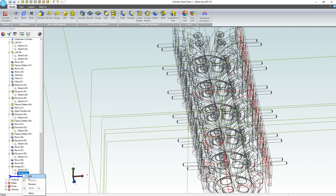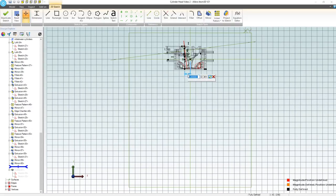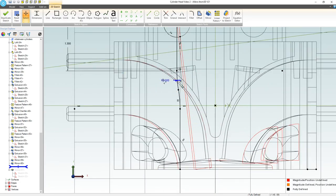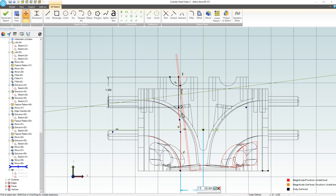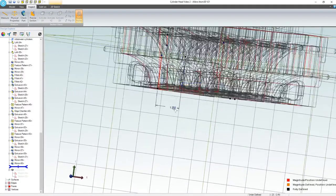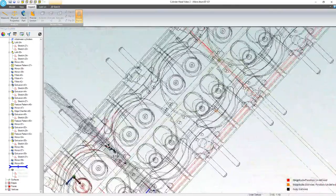I'm going to adjust that even more, right? So we're going to edit our path, and let me go with 1.25. And that doesn't work because of my arcs. I bet that zeroes out my arcs. 1.3. Nope. Looks like we can't find a solution no matter what, so I'm going to see if getting rid of that helps. 1.3. Nope. It doesn't help. So I'm going to get rid of one of my arcs because I really want this 1.25. I really want this to go farther out. That's a little bit too close, isn't it? So let's go with 1.125. That's better. It might be a thin wall at one part, but I think it'll work.